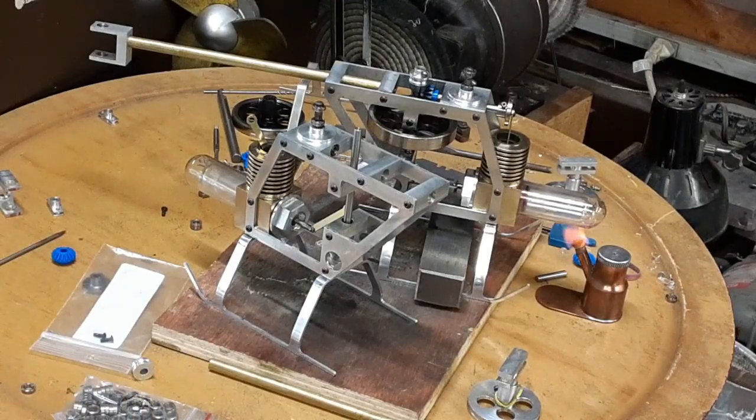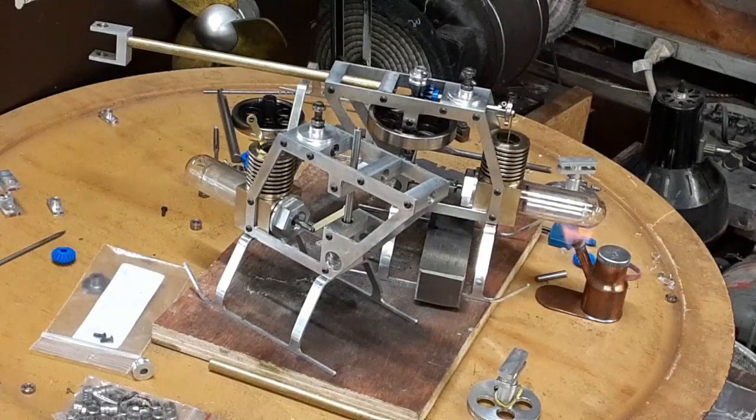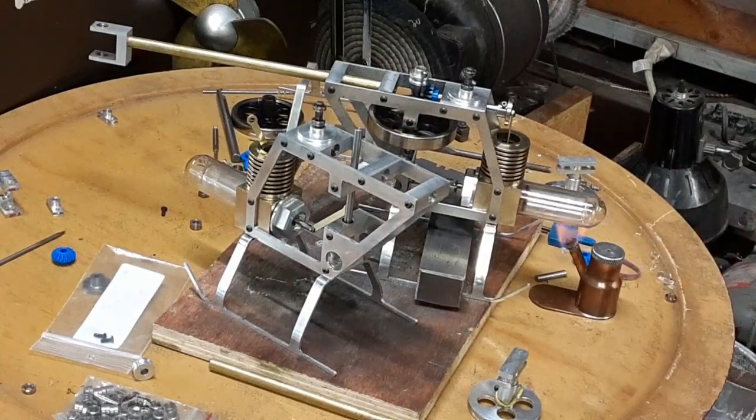The reason I wanted to make bevel gears is for the tail, because those plastic gears will not fit in the tail. They have to be small, like the ones that we're making. The ones we're making are pretty small. They're supposed to be 303 thou in diameter. I'm leaving it at a 312. So they're slightly larger than what they're supposed to be, but it's close enough. And the spud on the end I'm making is 250.